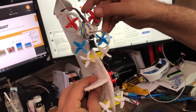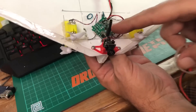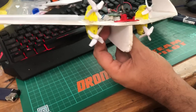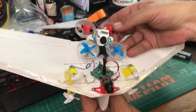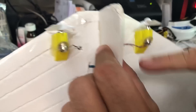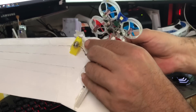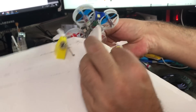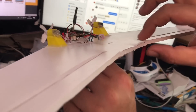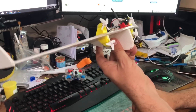I want to do a little measuring so people can see. It's pretty much tiny whoop width, but it's way, way bigger the other way. Another thing: this uses a Betaflight board. The motors are different — it's basically like a regular quad setup. This is an actual tiny whoop with an Inductrix board, so all the motors are the other way around. In a tiny whoop, there'd be red and blue instead of Betaflight's black and white pattern. These elevons don't actuate, but they give just a tiny bit of pitch correction — very necessary, because pitch wasn't working too well.